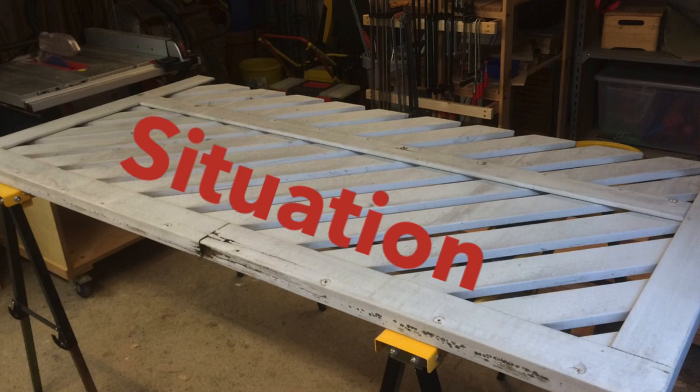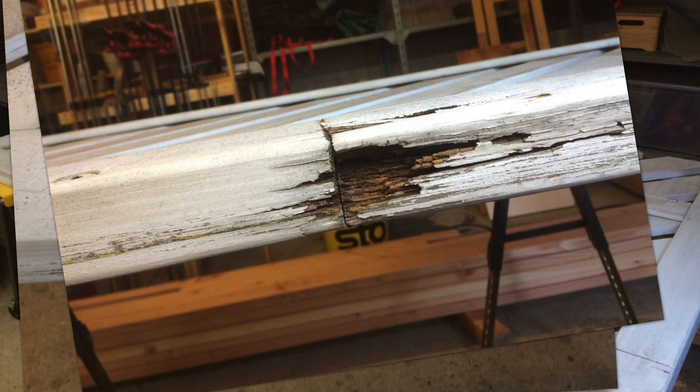The wood ran short and I had put together this frame from two shorter pieces with a glue joint in the middle. There are actually two dowels in there as well, but the glue joint didn't hold up very well to 17 years of weathering. The wood had got very rotten — you can see it here and in even more detail here. So there was only one way of keeping this piece of railing: replacing this frame, and that's what I'm going to show in this video.